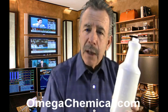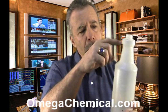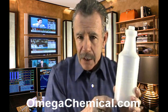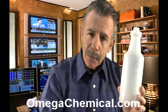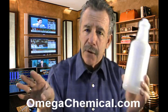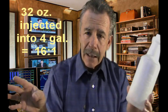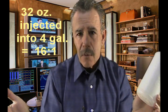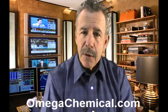Here's what you do: you look at the ratio. If you have pumped out a full bottle — which is 32 ounces, this is a quart — if you've drawn out 32 ounces through your downstream injector and your pressure washer has put out four gallons at the end of your hose and gun, then your ratio is 32 ounces to four gallons. 32 ounces is a fourth of a gallon, so if you've drawn a fourth of a gallon of product to four gallons of water, your ratio is 16 to 1. If you've drawn out 16 ounces to your four gallons, your ratio is 32 to 1.